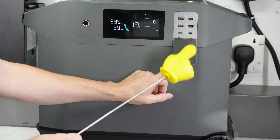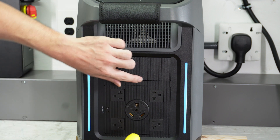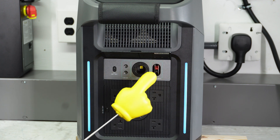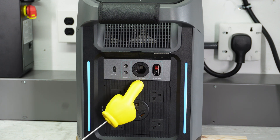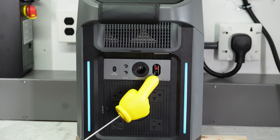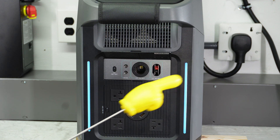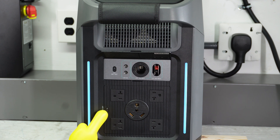To turn the DC panel on, you need to push a button on the back of the unit. On the back side, the on-off button for DC turns on the panel as well as the front USBs. We have 12-volt 3-amp barrel plugs, a cigarette socket at 10 amps, and 30 amps at 12 volts — really handy for RV use to power tip-outs. Down here we have four 20-amp 120-volt receptacles as well as a TT30 plug for plugging in your RV, which will have no problem running an air conditioner.